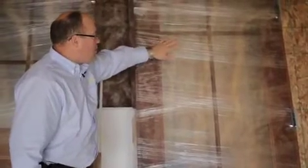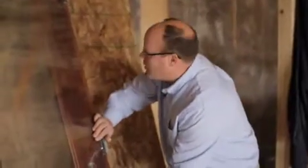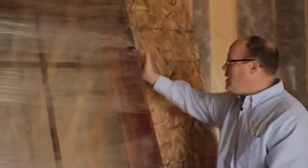Once we've put all this packaging on, we shrink wrap the whole product. The door hinges — the hinge screws are an inch and a quarter, which means they stick out roughly half an inch. We'll put a piece of foam so that it covers the screws when you're handling the door. One of the complaints we heard from customers was that people were cutting their hands open with the screws. So we just take a piece of foam, push it on, and then shrink wrap it so the door can be handled safely.